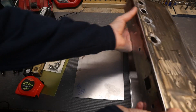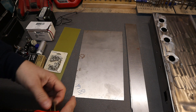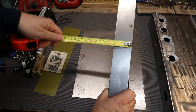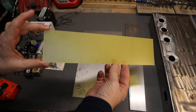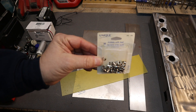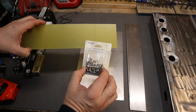Let's get into the build. We're going to build our own chassis from scratch, similar to this other build I'm working on. I got some 18-gauge sheet metal and had it sheared at the metal store — it's 11.5 by 6.5 inches and the sides are 2 inches tall. For the eyelet board, I got a piece of phenolic from an industrial plastic supply store — 3 inches wide — along with some standard eyelets and a tool to press them in. Once the layout is figured out we'll drill the holes and press the eyelets in.